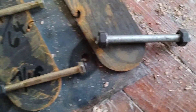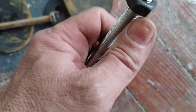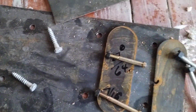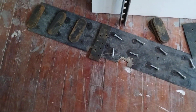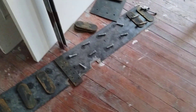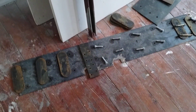For the all-thread, you can cut it to length and washer it on top of this plate. You're going with clamp force - you can grease the back of the bolt head. Make sure you get the correct nut face showing - you can ask me what the correct face is. Also, look at this - it's a bump cap. There's a hard liner in there; it's not a hard hat but it's called a bump cap. It's low profile, comes in different colors, and it's saved me many times. They're not OSHA-rated, but if you're not wearing a hard hat, wear one of these instead - you will be thanking me. Take care, love you guys, bye.